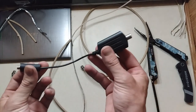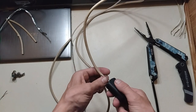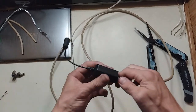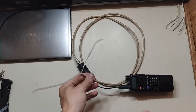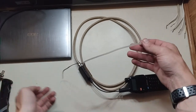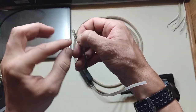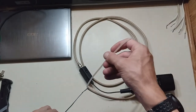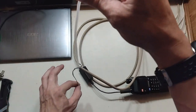Kind of made myself a little casing, and there is an adapter for it. I haven't gone online to check if there are adapters, but I am sure there is. I am going to go back and re-measure real quick, make sure it is all tuned. Both of them are at 6 inches — some are at 6.1 inches. You can make another little hole at the end and put a string through there with your insulator and something with a little weight, so you can hang this up. Cut a little eyelet and just hang it as your little dipole.